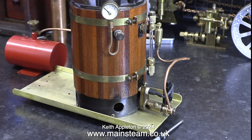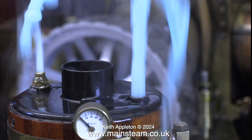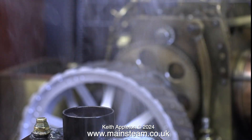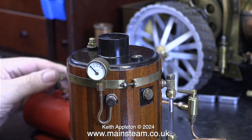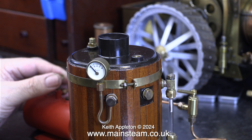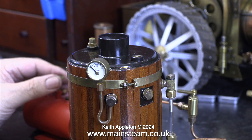While waiting for the steam to appear, a kind viewer told me that this was a Creek Victoria steam launch. There is evidence of some steam coming out of the hole at the top of the boiler — followed by this lot. This is called priming, and it's not even under pressure. It's extremely dangerous because this is a mixture of boiling water and formic acid. I show things like this so that you do not have to do the same. Seriously, this is very dangerous indeed — formic acid is corrosive, particularly when it's hot.